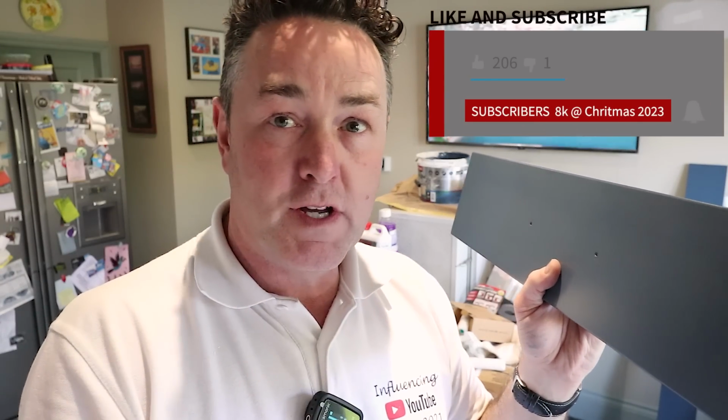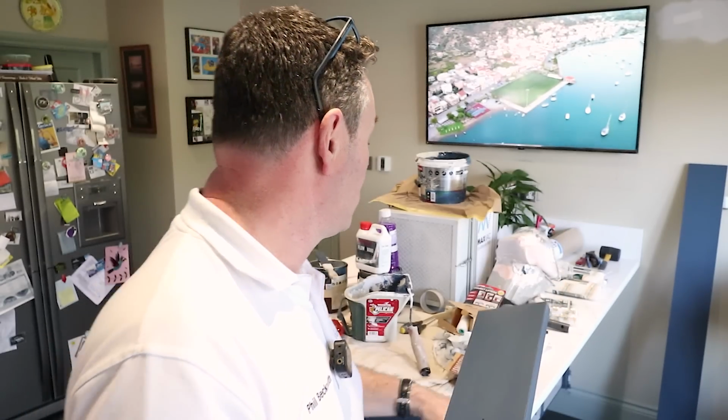Now, face on, it doesn't look too bad. Don't forget this only had one coat. But what I want to do, as I said to you on days gone by, which is not that long ago on this video, I would be applying the undercoat with the 10mm. I'd do the first coat of finish with a 10mm and then I would drop onto a 5mm because that's the recommended way of doing roller work, particularly with two fussy blokes. 10mm for your undercoats and then finish off with your top coats with a 5mm.